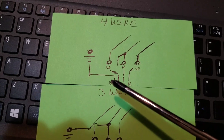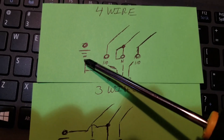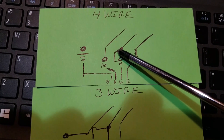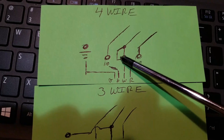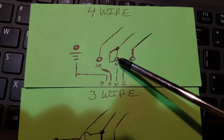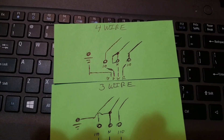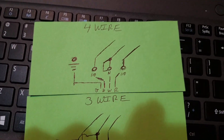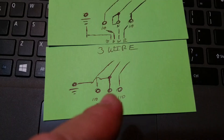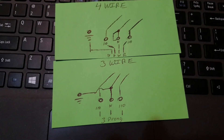Anything happens in here and sends voltage to the cabinet, you don't want to be the source of ground and get electrocuted — you want it to go straight to ground. What we have here is our 110, our neutral, our 110, and our green ground wire to the plug. As you can see I've illustrated the pigtail that in some appliances — when you have the three-wire hookup — you bring over to neutral, but in this four-wire diagram you want to make sure the neutral is isolated from ground. I hope I didn't confuse you any more, but I just wanted to show you the difference and how imperative it is to make sure the three-wire connection is properly grounded to that neutral. Thanks for watching.